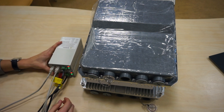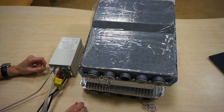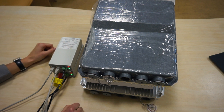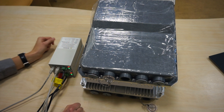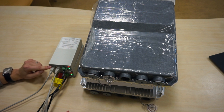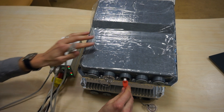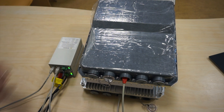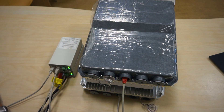To apply the power, I am using SAF provided PoE injectors and SAF provided AC to DC power adapters. I have prepared the connectors — make sure when you crimp them that you connect the minus sign on the left and the plus sign on the right side. This connector with plus power is the port that needs to go to Integra E to power it up, and the port on the left side is going to go to my PC. So now I am going to apply the power to both of the Integra E units. You can see the green lights are lighting up on the Integra E and you can also see that my PoE injectors are showing all green lights. That indicates that there is a load.